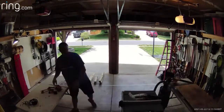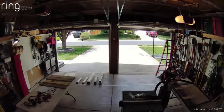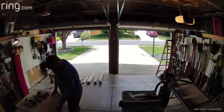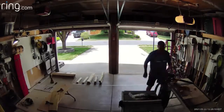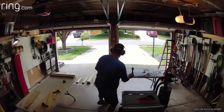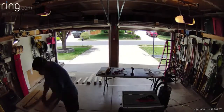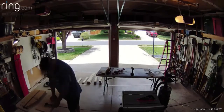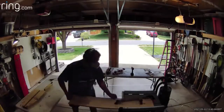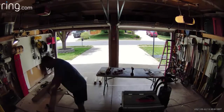Now I'm done with the miter saw, so I'm setting up all of the angled cuts. This is a really cool jig I made. Right there you see me with the template — this is a jig that holds the board exactly the way you want it, so all you have to do is pass it through the table saw. It's repeatable and makes a really straight, perfect cut with very little setup time. I got smart this time and made pencil marks exactly where the board goes, so next time I don't even have to trace it with the template — I can just put it on the marks, with the little hold-down clamps.